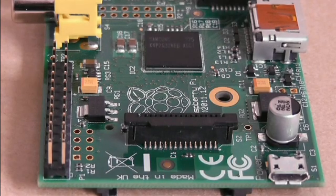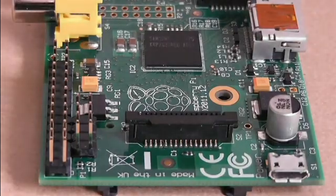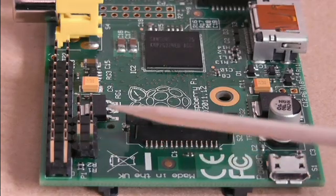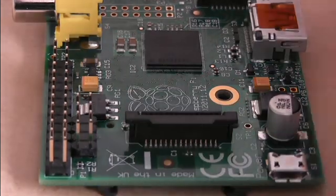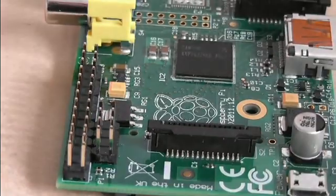I'm going to put a header in the top side in the most obvious way that most people would think of to start with. If you put an eight pin straight header face up where you would obviously think it should go, it's very close to the existing header.